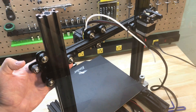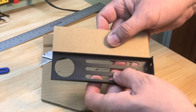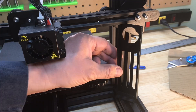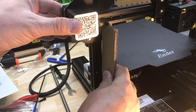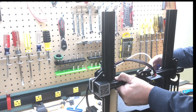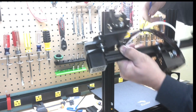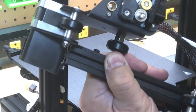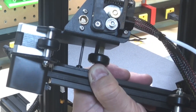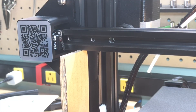Now we want to make sure this beam is level. What I like to do is measure the spool holder bracket, which is 15 millimeters, and cut a piece of cardboard out of the box to match it. Then I place the beam on one side with the bracket and use the cardboard as a guide. I get it in position, hold that bracket where the two screws are, bring the thing all the way up, and tighten those two screws. You may have to do this two or three times to get it perfect, but when you do, that cardboard should slide right under the beam on both sides at the same height.